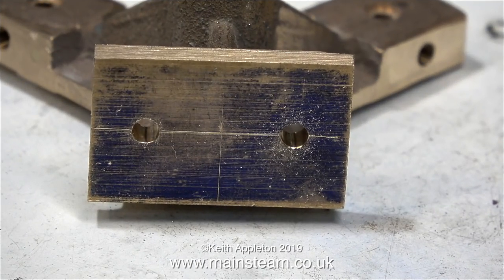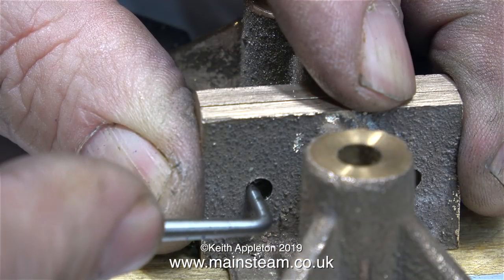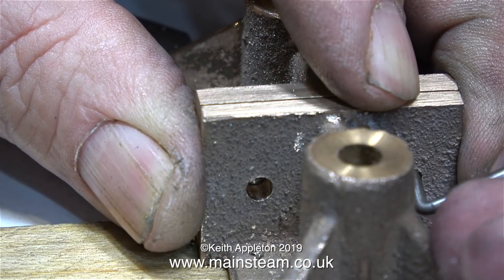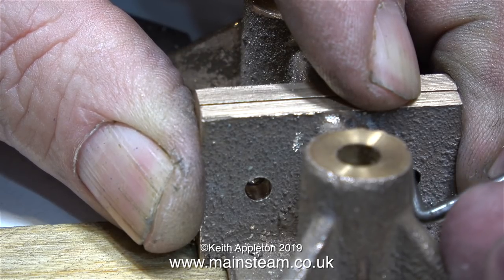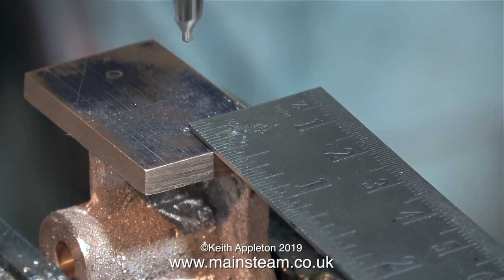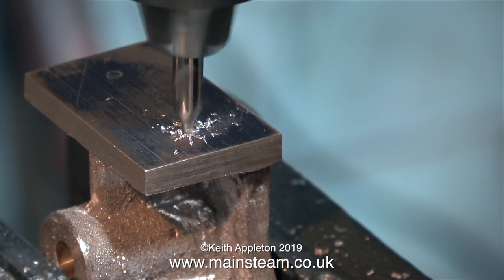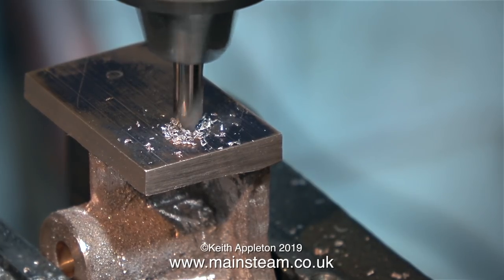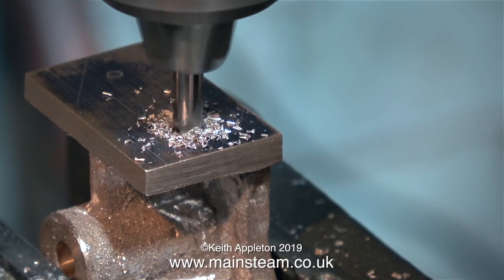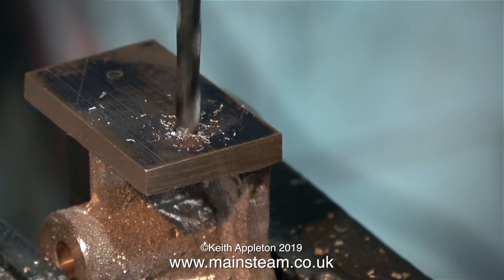Because the base itself will be threaded. Here are two 5/32-inch diameter holes that I've drilled in the first of the standards. Now I need to drill two more holes in the second standard in exactly the same position. So the easiest way to do this is to hold the parts together and use a scriber to mark the hole position. Then it's back over to the drilling machine, and as always I'm using a centre drill. I've made a little spot on the mark where I think it should be, checked it with a ruler - it's okay - so now I can go all the way through. And to save moving the position, I just fitted a twist drill into the chuck and went straight through with that.